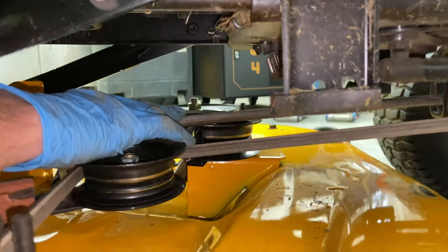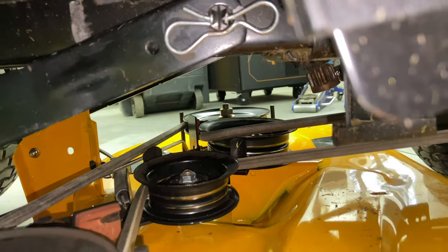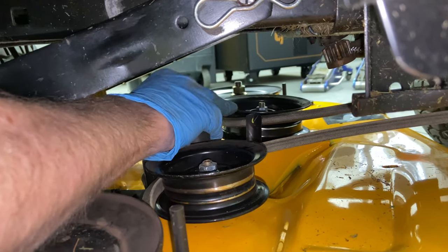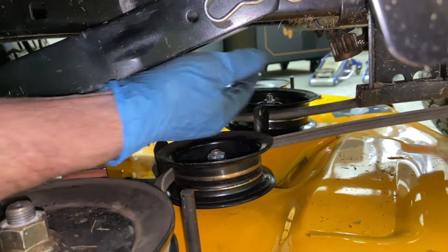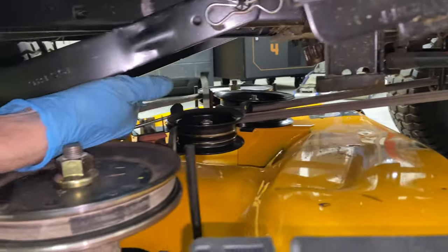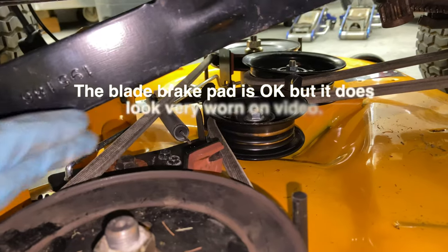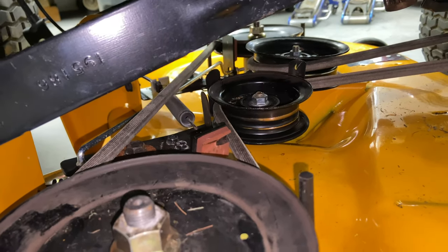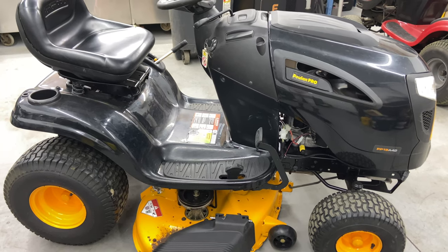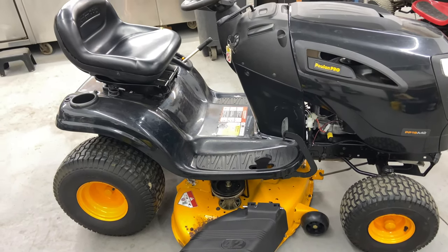One thing you should do after you have the mower deck on and adjusted: make sure you engage your mower deck blade, then come under your deck and make sure all the belts are facing the correct way. This is a perfect example of why I double-check everything — this mower deck belt is actually up off the pulley; it came out of its little metal finger. If you leave it, it'll jump to the other side and wear the belt out within five minutes. Luckily I saw that. Re-engage it, check your belt tension — which is tight — and make sure your belt is running above everything it should be and your spring on the other side is in the right hole and not rubbing anything. Everything looks good. Take it outside and run it. That pretty much sums it up for how to remove and install the mower deck and install an adjuster for the other side. If you like this video, please give it a thumbs up, subscribe, tell your friends about my channel, and I'll catch you on the next one.